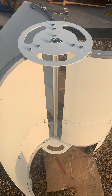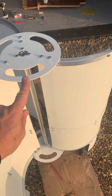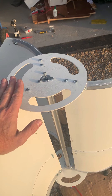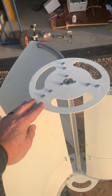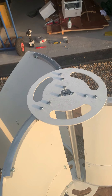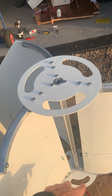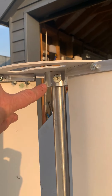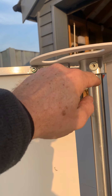As you put it together, I've actually done the bottom spindle first. Then I've put the shaft in, and then I've put the top spindle plate on. The reason for that is I found on version 1 that the shaft isn't a completely smooth fit through both bushes. If you try and shove it in at the top through here, you'll get stuck and you'll damage it. So the best thing to do is put the shaft in first, tighten it up at the bottom, and then tighten the top plate on after that.